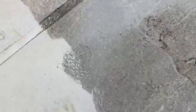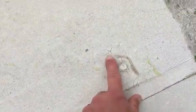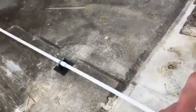But again, I just want to stress the importance of this entire roof. It's about to be too far gone to be able to recover it. And when that happens, and the insulation board underneath this membrane starts taking on too much moisture, this whole entire system will have to be torn off and a whole new roof put on, because it won't be able to be recovered at that point — it's just going to have too much moisture in there.